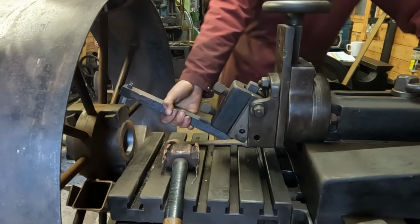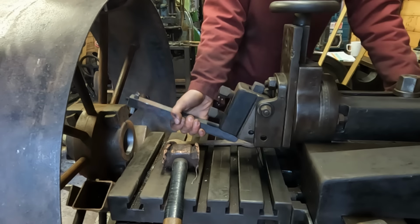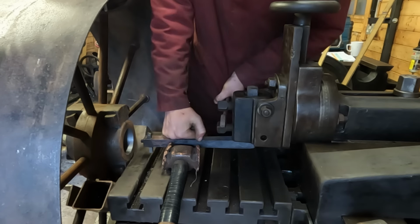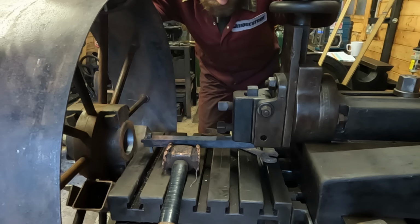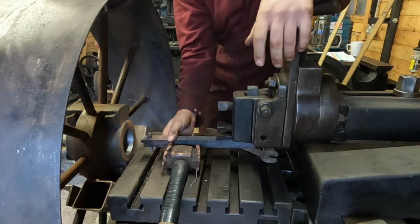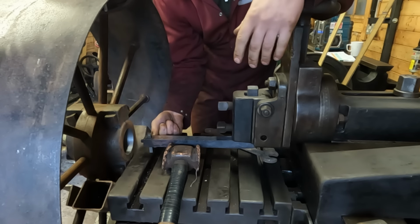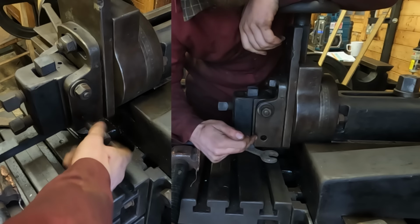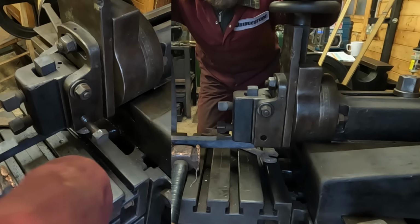There's always something in there. There's a few things we need to do before we can start cutting. First things first is I need to lock the clapper, because the leverage on this end is going to cause the tool to lift when it comes under load and it won't be cutting. So there is a locking point here. I need to find a bolt for that. It's unnecessarily long, but it will do the job.